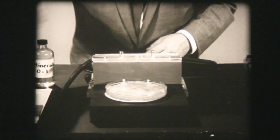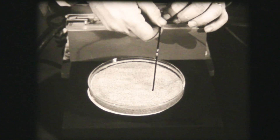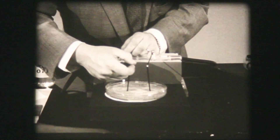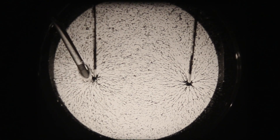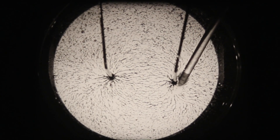Now, let's try our first experiment. We take a piece of clothes hanger wire, bent at right angles, inserted into the post with the other end in the liquid. We repeat this with the other post. Now, turn on the current. Observe the seeds aligning themselves radially around each wire. We push the wires closer together. The seeds align themselves with the field to form a dipole pattern, showing us the shape of this electric field.